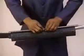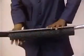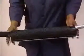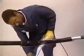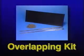The second sleeve's rail and channel must be rotated 180 degrees from the first sleeve's rail and channel. The installation may be completed following the procedures already demonstrated. If more than two WRSS full length sleeves are required for repair, be sure to use additional Raychem overlapping kits to ensure total sealing of the cable opening prior to the installation of the additional sleeves.